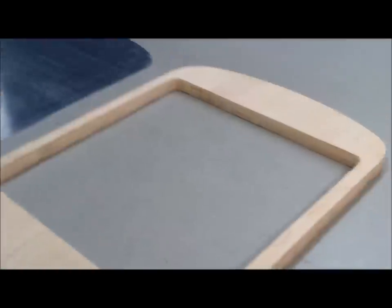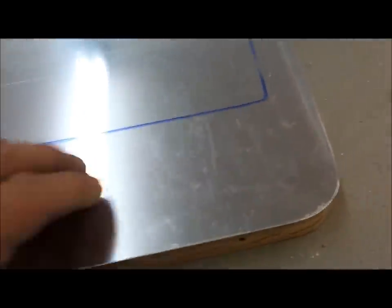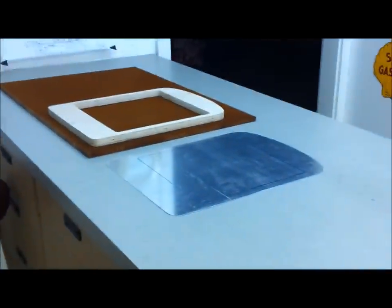I finished making the cutout in the piece of plywood where the radiator is going to go and sanded it, so it's all prepped and ready. Then I wrapped this piece of polished aluminum — it's just slightly bigger so I can trim it with a router. I'm going to glue it on first, drill a hole, and then run my router around it inside and out. I also have to trace around the inside and get the honeycomb to fit in there, and then paint this edge black. It's kind of a sequence, but I think it's going to turn out just fine.